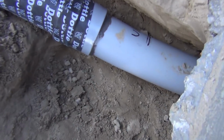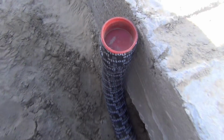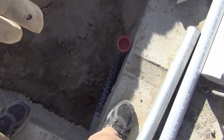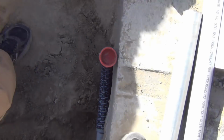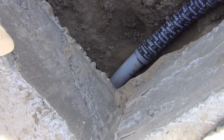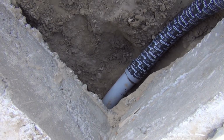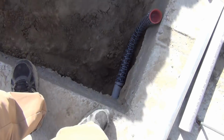You can see where it says up on the corner there, and how my conduit's just dead nuts on. It's perfectly straight up, and it comes up right on the edge of the footing. I chipped the cement back a little bit on the little lip there. I'm going to backfill this and then soak it and let it dry, and then pack it with a hammer. Basically hit from the sides with a sledgehammer when it's in that pasty phase.